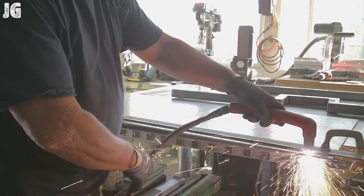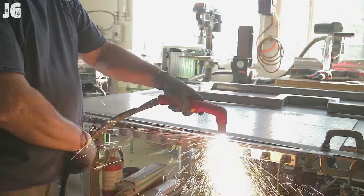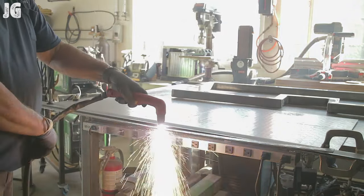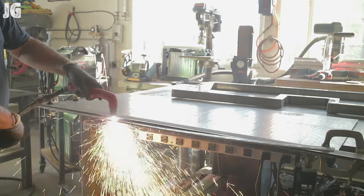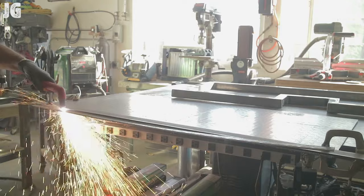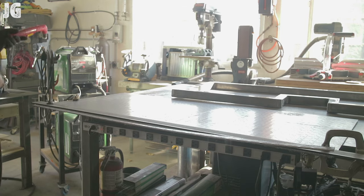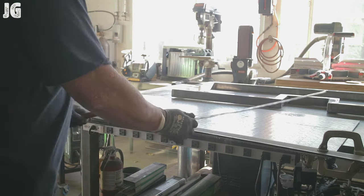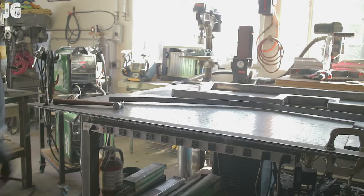Cutting this out — it's a little bit difficult cutting diamond plate with a plasma cutter. I think it's the two different heights: if it's a nice smooth plate the plasma cutter burns right through perfectly with a clean cut, but with diamond plate it jumps from a thin part to a thick part and the cutter can't quite decide. Nevertheless, it was a clean cut — it just took a little extra effort to get the piece off. Once I got it off you can see it's a pretty clean cut, just going to require a little bit of grinding.